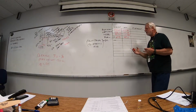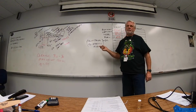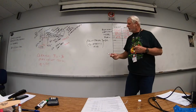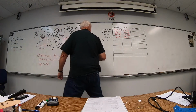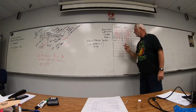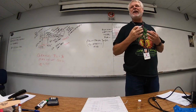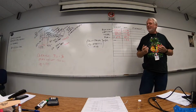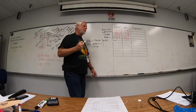Now remember, we've got to take our oil out, that's drainable oil, because it was built prior to March 1, 1978. If it was after that, the full oil quantity would be part of the empty weight. So in this case, we know we had 4 quarts of drainable oil at a negative 13.5, because it is left of the datum. That's a negative number. And we know lubricating oil is 7.5 pounds per gallon. We just happen to be conveniently 4 quarts in a gallon. So we know then we have 7.5 pounds. That will be a negative number.